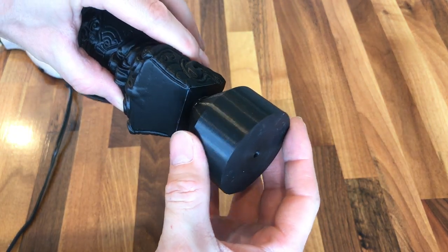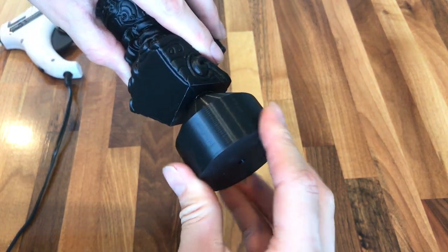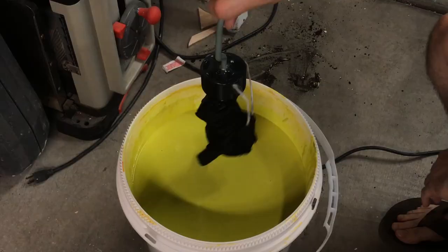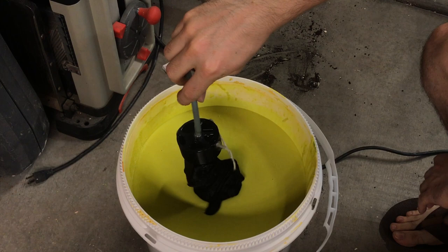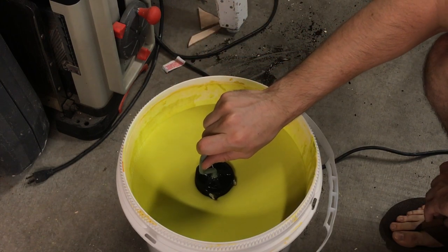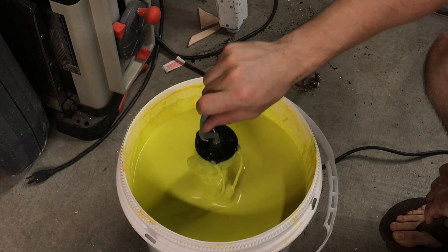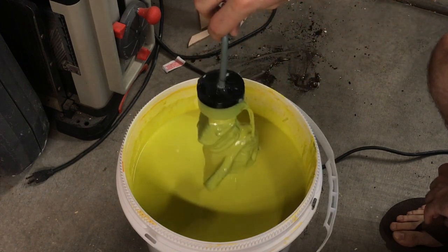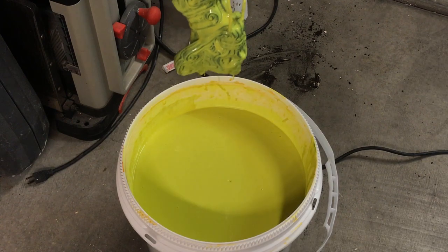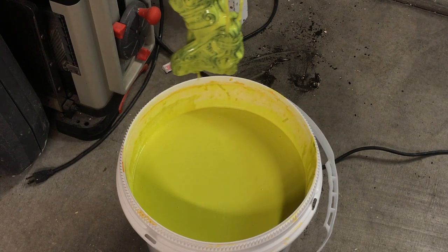Like with the stormtrooper casting, I glued on a 3D printed sprue but also glued on some thin vents which run from the chin to the top of the sprue or pouring basin. I coated the statue with nine coats of ceramic material and sand, followed by one final coat without sand.